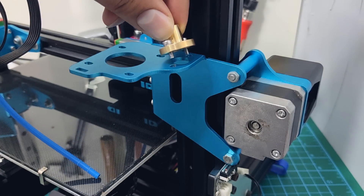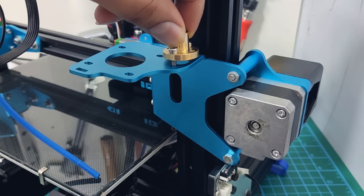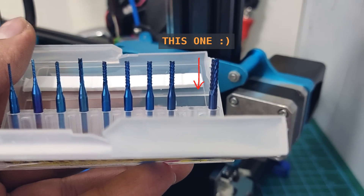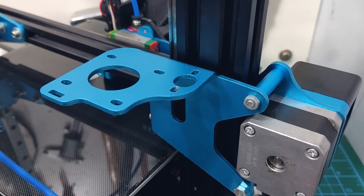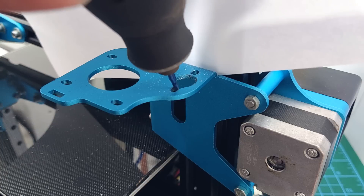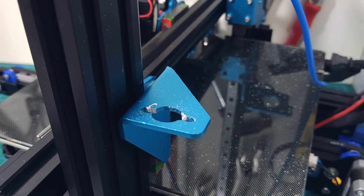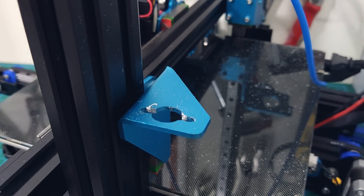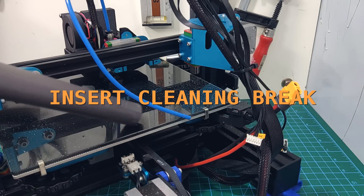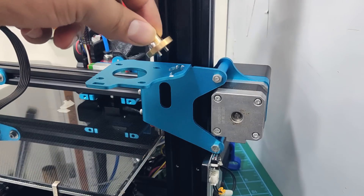So let's start fixing these problems. I had a small problem with my BLV kit — the spacing between the nut slots was very tight, so I had to get out my trusty old Dremel. I will use one of these engraving bits that I got from Banggood. I used an A4 paper to protect the rails from the metal shavings, but it would be much better to do this before assembling the printer. Unfortunately, the dust got everywhere, but finally it was done.